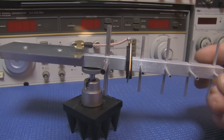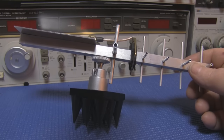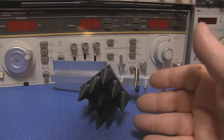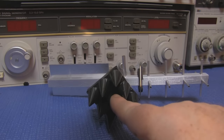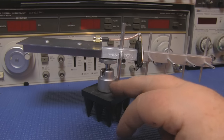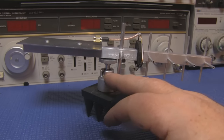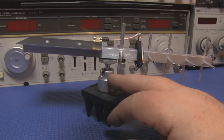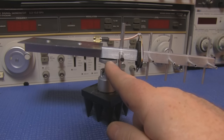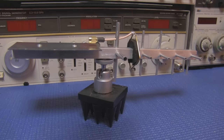Next I'm going to test out this little Yagi — another antenna I've been working on recently. I wanted to quickly show you the mounting I've come up with: I've used one of the original test tiles from when I was designing the anechoic chamber, and that slots into the cones on the base of the chamber quite nicely. I've epoxied the top of one of those cheap tripod mounts onto it — they're virtually all plastic inside — super-glued the plastic ball joint onto the mount and removed the metal screw, so now it just holds different types of antennas for testing.